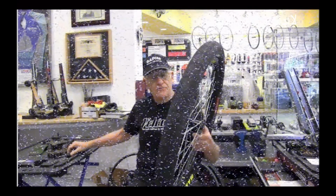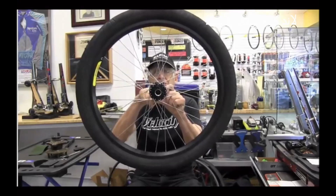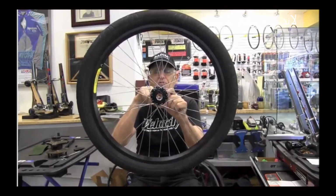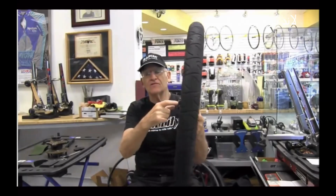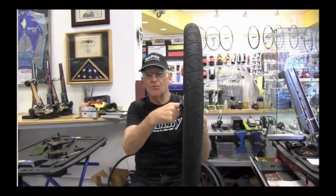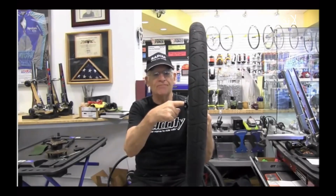After I take out the bearing, if I look at it this way, you can see that I've got a big hole which is a constant diameter. If I can make an axle go through that, a 22mm axle, that obviously is going to make a much stronger axle to support the wheel than intended for the skewer.